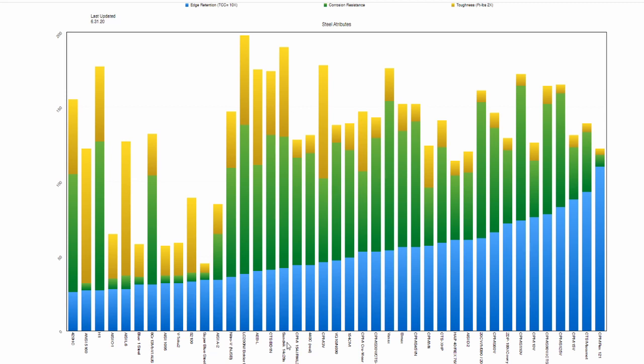It's a little trickier to get as custom makers. They only want to sell you enough to make 10,000 knives. But you can find it here and there. That's a fantastic steel too. AEBL, I like AEBL a lot in a bushcraft knife or something like that, where people traditionally use carbon steels, but it is not particularly corrosion resistant. It's a little better than D2, but not a lot.